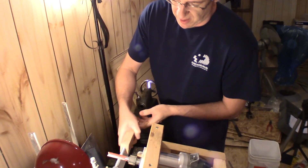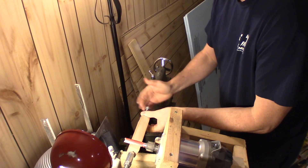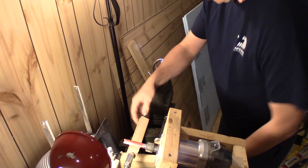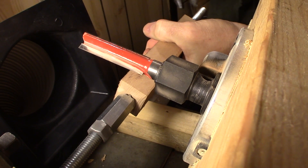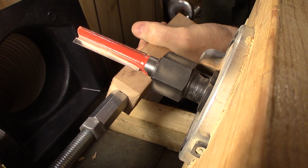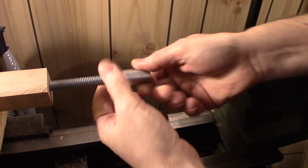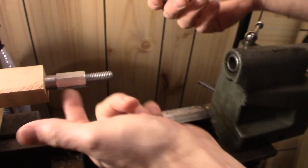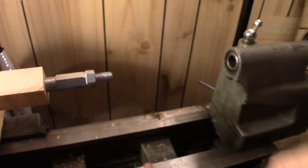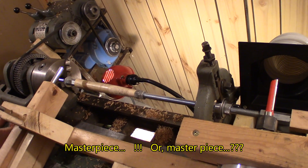I'm going to load the blank into my machine. Line it up with the other one that's there — that's the master. All I'm doing is I've got two little points that keep the blank in place to keep it from losing its index. So I seat it in place by forcing it on. There we go, that should be in its place. Now I'm going to set up the end. When I finish turning, it's actually rather small, so I thin down the end of one of the nuts — that just gives me a place to run into at the end of the process.